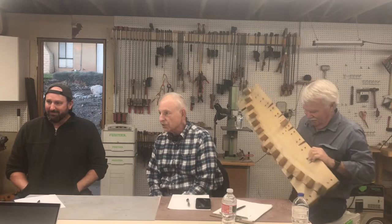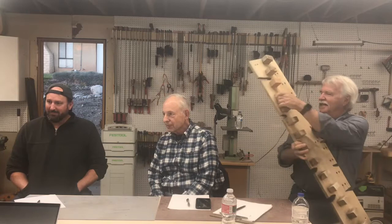Do you have a sanding machine? I'm sorry, do you have a drum sanding machine of any? I've got a drum and a 20-inch disc that I can build it to. Okay, well, if you have a drum sander, you might want to make a sled for it, depending on the lengths of the piece. Put the thicker strip of wood on the sled and run it through your sanding machine, because when you start getting down to 50 thousandths of an inch, you run the risk of running your belt up against the sand, the drum sander. Right, that's what I did with the disc sander that I made. I made a carriage for it.